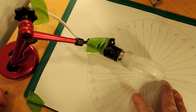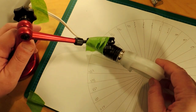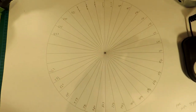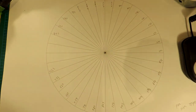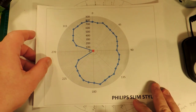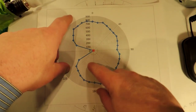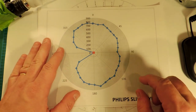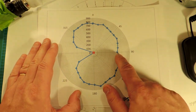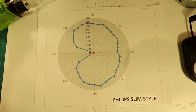Let's talk about light intensity as a polar graph. I had to resort to a stand here to keep the bulb in the right orientation, and then I mapped out the intensity. The bulb is probably actually different depending on its orientation, but when it's in this vertical orientation, you get what looks like not a bad pattern. However, the way I'm doing this is not quite sensitive enough to show what is probably an extremely deep divot at the very top of the bulb, which is resulting in this really strange dark banding.